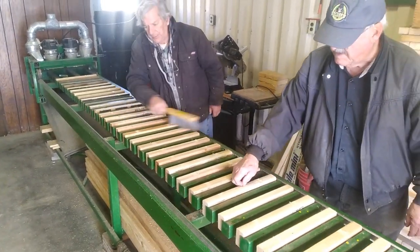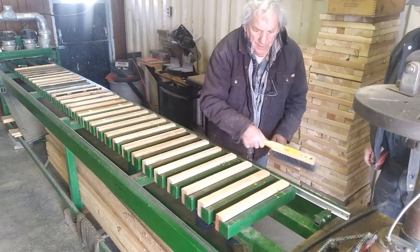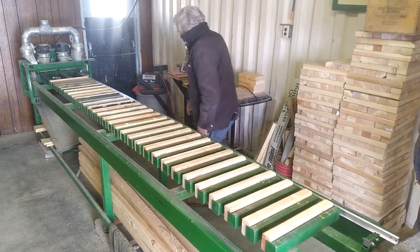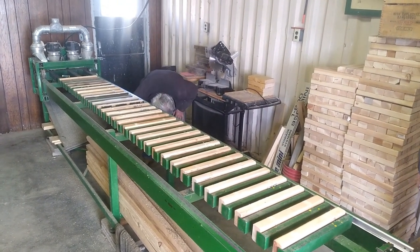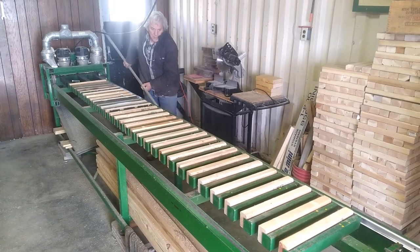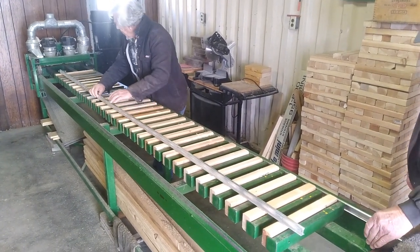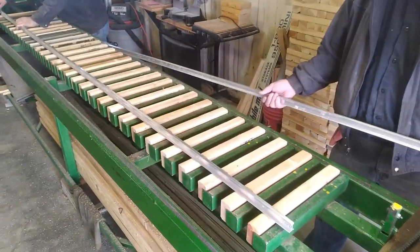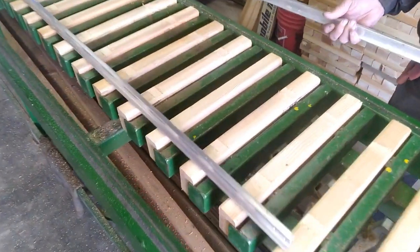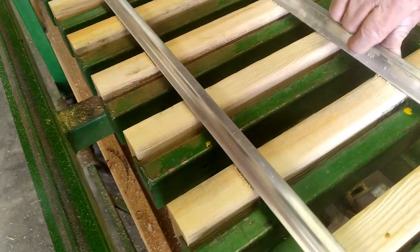As you can see now, there are grooves in the ties. These ties will now receive two pieces of rail. The rail will rest in the bottom of these grooves. These grooves aren't relied on one hundred percent for gauging, but they do help us gauge during the screwing down process.